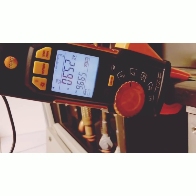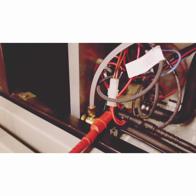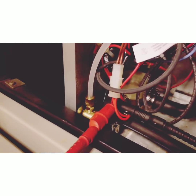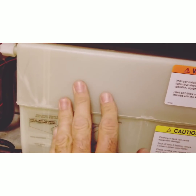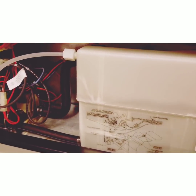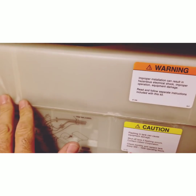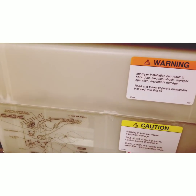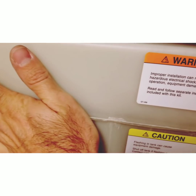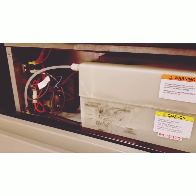We're back into the swing of it. My relay's not jumped out anymore. We got 25 volts at the fill valve and we can hear that water hissing by. It should just be a matter of time before we start boiling inside the tank. And there it is — nice boiling water creating steam. The tank is hot like a spicy meatball. That's the repair. You guys have a great day. Happy HVACing.